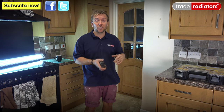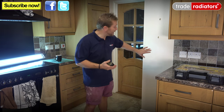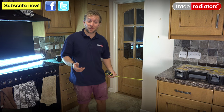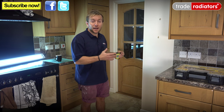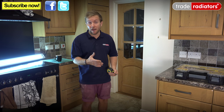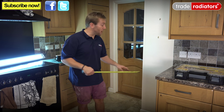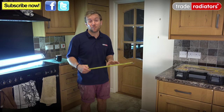We've got a little radiator just out of shot. The only wall that's viable to increase the BTU is this little wall here. When we measure it we've only got about 43cm to play with — a very narrow bit of wall. So we need to get a column radiator that's double-panelled but also very tall, say about 1800mm. We've got two heating pipes just on the other side of this wall, which makes this job very convenient — we've already drained the whole heating system and we're ready to go.